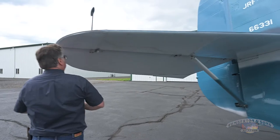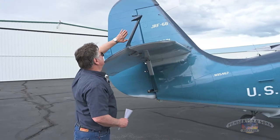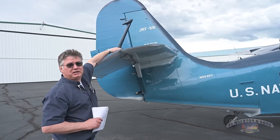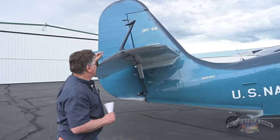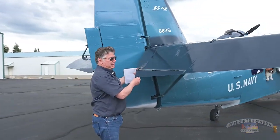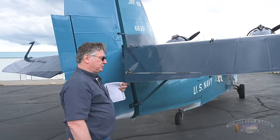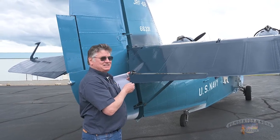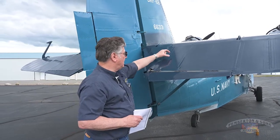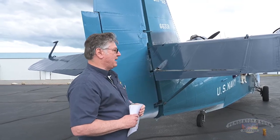As we work our way around, we've got an aerodynamic counterbalance on top of the elevator, and I always smack that to make sure it's secure. Obviously if it came loose and broke off, it could potentially cause elevator flutter. I'm going to work my way to the trim tab, looking for play in the linkage — it needs to be no more than 3/16 of an inch. I like to keep it around 1/16, and when you start seeing play you can shim the trim regulator with 30-thousandth shims.